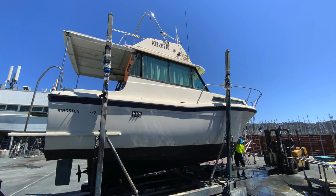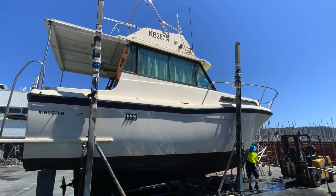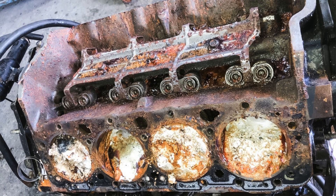If it hasn't caused any structural damage over the last 30-40 years and the hull's not cored, then most people will just leave it and monitor it over time. It might come out each time someone tries to sell the boat at survey, but it's not really a deal-breaker. Being that the boat's probably 30 or 40 years old, you're more likely going to have bigger fish to fry, like things such as engines and electrical that are going to still be original, and that's where I'd be spending my money.